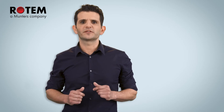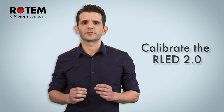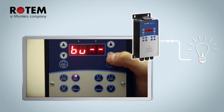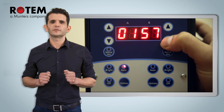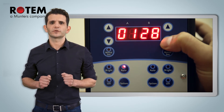The next step is critical. You need to calibrate your RLED 2.0 to work with your specific bulbs. What this means is that you define the minimum lighting level. Before you start, your RLED 2.0 must be connected to the light bulbs. Press and hold the option button for three seconds. Now adjust the pulse width to get it to the minimum lighting level that you want.